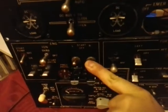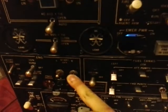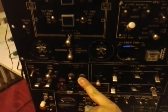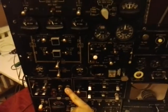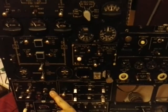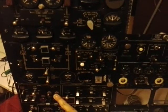we have everything ready. I think we can use starters. Yeah. We have the pressure. So starter number 2 is on, and on my computer I will start the fuel shortly. Here comes the fuel. We'll see some jumpings as the bus connects. Sorry, I switched the left fuel for the right engine, so obviously it can't work, but now it should be okay.